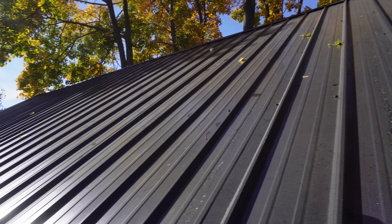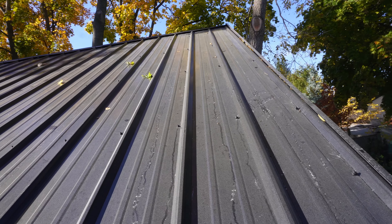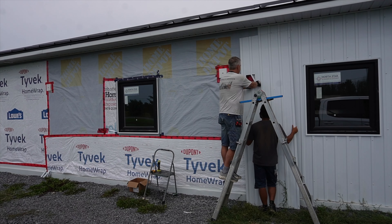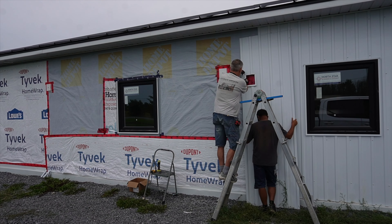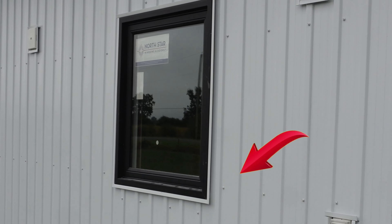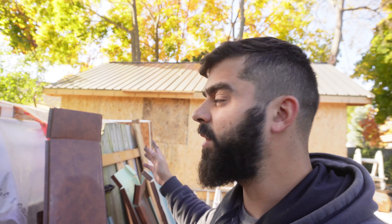Not that anybody's going to look up here after the fact, but for example with siding along the building, it's nice when all the screws line up. If you already have your sheets up there, the best way to get screws that line up is: measure one side, put a screw on that end, put a screw on that end, put a string across it tight, and then fill in your screws in the middle — and they'll always line up nice.